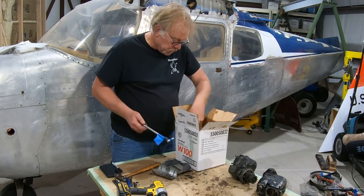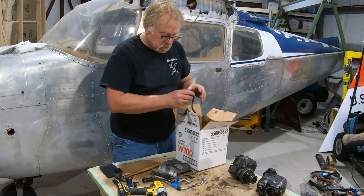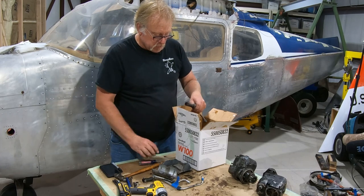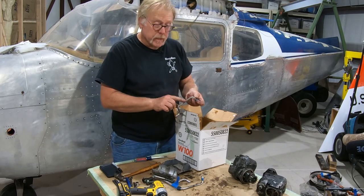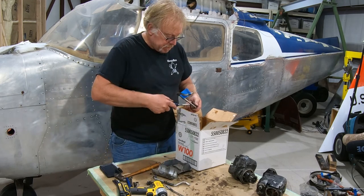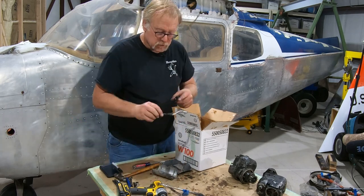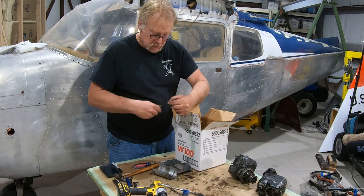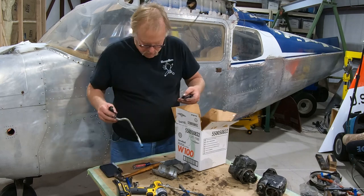So we have, okay, drain back tubes. 1, 2, 3, 4. Okie doke. Cool. Let's see if we can get these things off of here. And this will all get cleaned up separately. Not a problem. So we'll check for chafes and whatnot. Nice thing about Lycoming is they actually put the part numbers on the tubes, which is kind of neat. So that'll be cool. Got a little twisty stuff on here, some automotive wrap. Nice, and you can see how it chafes quite nicely. And that is rubbish. We'll get rid of that crap.